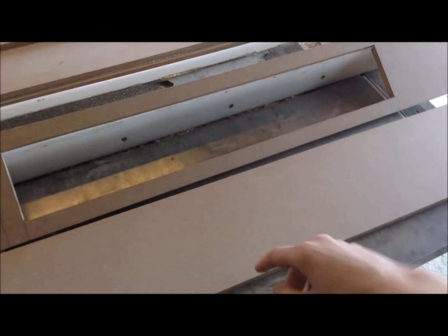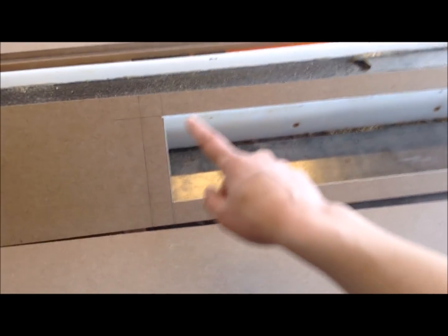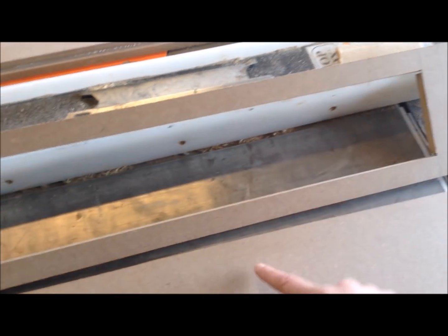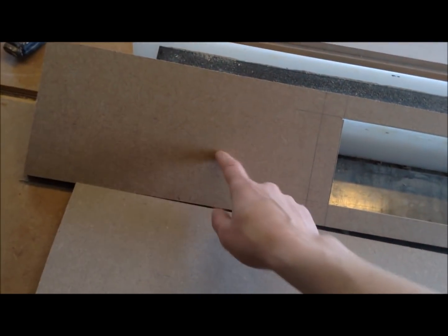So with that slab cut, I can now glue these together, and I'm going to be applying glue to the detail piece and then brad nailing it onto this one to secure it. So I'm not going to be putting brads in the two stretches because you'll see those, but where the plinth block is going and where the excess is, you'll never see.